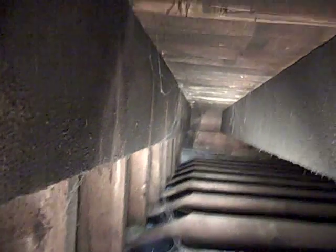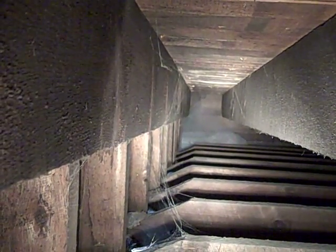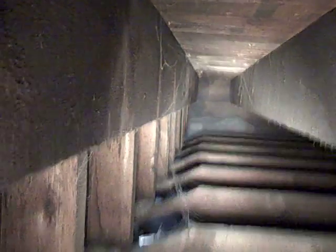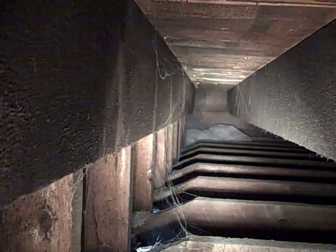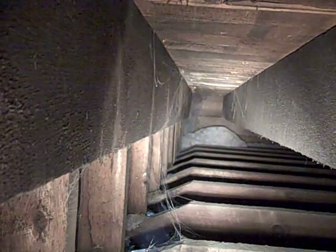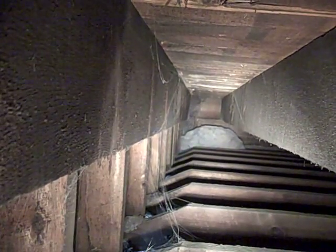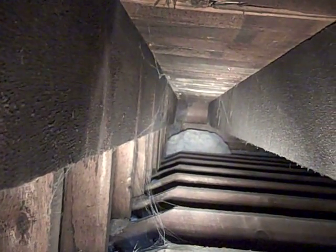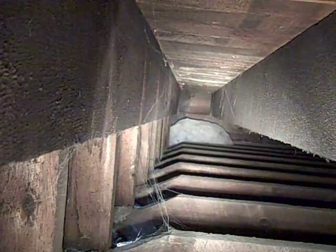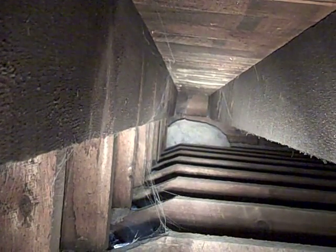At the very end you might be able to see it — it's a white, kind of a nylon bag. You can see some of the fill going in. It's like an onion bag; it's very porous but the holes are small enough to catch the cellulose. What we're trying to do is fill not only the joist cavity but also this seven-inch gap between the top of the lower joist and the bottom of the upper joist — they run perpendicular.